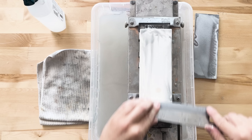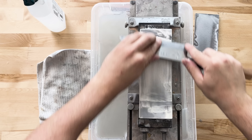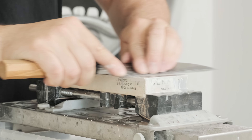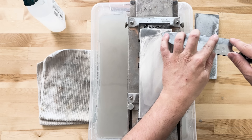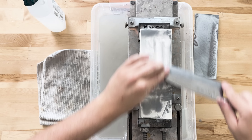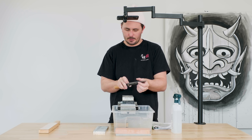Another little tip: I try to use the full length of my stone, or as much of it as possible. This is going to help your stone do the work for you, rather than you doing all the work. You will have to do some smaller strokes as well of course, but try when you can to use as much of the stone as possible. Things are feeling good — I've formed the burr on side A and side B, so now I'm going to do my deburring strokes.